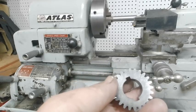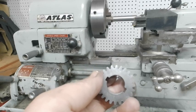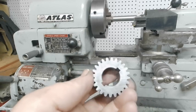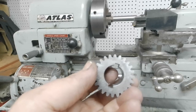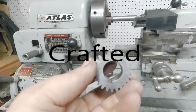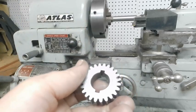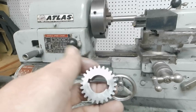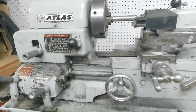What I have is a 24-tooth gear. I watched a YouTube video — I'll put a link to it in the description, I believe the channel is called Craftsman, I'll link it. This 24-tooth gear is going to change my feed rate and essentially cut that four-thousandths and two-tenths down to two-thousandths and one-tenth. That comes with some essential changes to our quick change gearbox, which we'll go over.